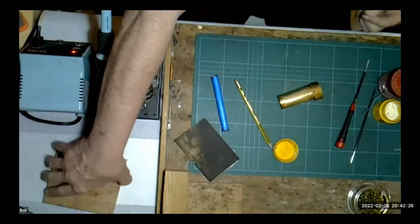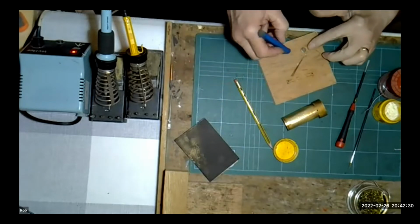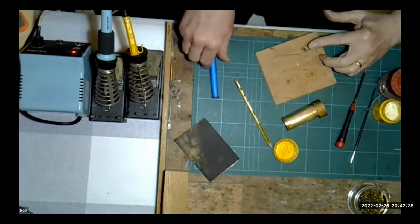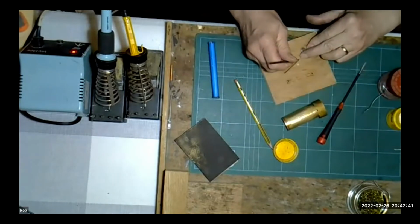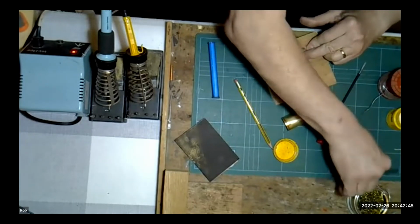Right, the other one on that same query was boiler bands, was it not? Yes. Okay, boiler bands, a similar process. I need a piece of plywood back. I've partially tinned this one, but I will just tin the underside of it. Let's give it a little rundown. These are only about three thou thick, so they're quite delicate. So again, I would just tin that,